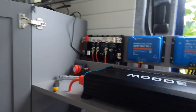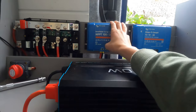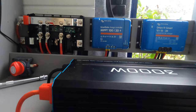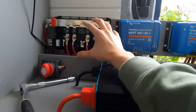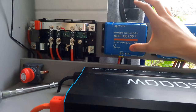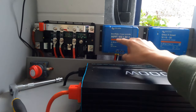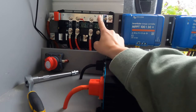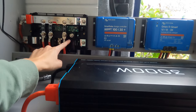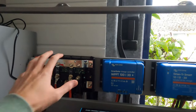I'm going to take a break and walk through what I've been doing. In the back of my electrical cupboard I've now got my DC-to-DC charger, my solar charge controller, my Lynx distributor, my big Renogy inverter, and my isolator - which is off because I'm working on the system. The electricity comes through the DC-to-DC charger from the starter battery and through the MPPT from the solar panels, into the Lynx distributor. Then one output goes to the inverter for 230-volt connections, and the other will go out to a 12-volt switchboard.